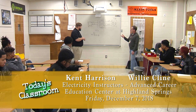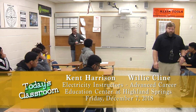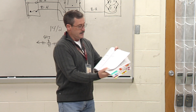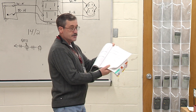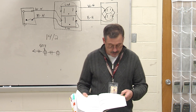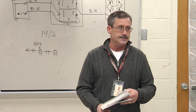Can we talk about Article 210? In your National Electrical Code book — we haven't really introduced the code book to you yet, but it will be coming. In Article 210.8, it's going to list everywhere you are required to install a GFCI. For example, in dwelling units — which is a house — bathrooms for sure, garages or separate buildings, outdoors if you have outdoor receptacles, crawl spaces. What's in common with all of this? Water — you can get damp. Also in your kitchen, especially on the countertop. Think mostly of your wet or damp locations — that's where they're required to be.